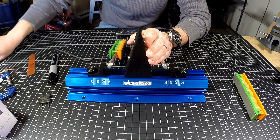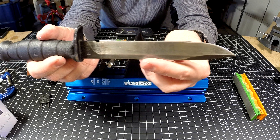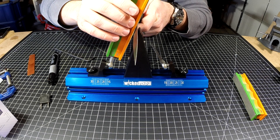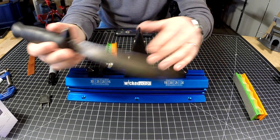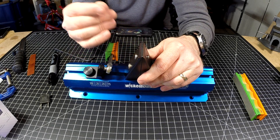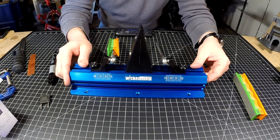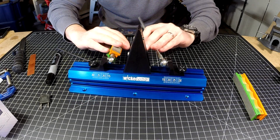If your knife has a full flat grind — like most Spydercos — and doesn't have a flat portion near the spine for clamping, it's going to be a nightmare. As soon as you put it in and push on one side, it rotates; from the other side it rotates the other way. Full flat grind knives are not the best in this sharpener. You can shim it or clamp closer to the tang to make it work, but it's not ideal.